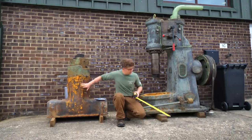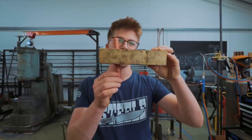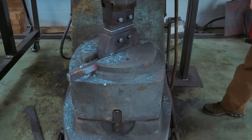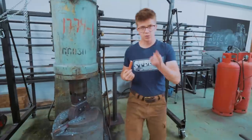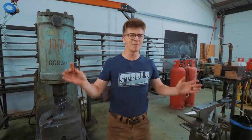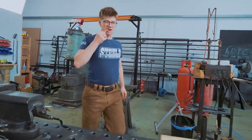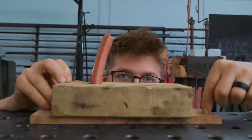The Bernsdorfer is a two-piece power hammer — one less than three — meaning the anvil slips inside the body of the machine and is separate. That makes it a lot more complicated. On a one-piece machine the base just sits flat on the ground; if you need to move it, it's one single lift. Two-piece power hammers are meant to require foundations and a whole manner of complexity. We don't want any of that — I like simplicity. So in order to make it one piece, what we're going to need is a base. Let's take some measurements.